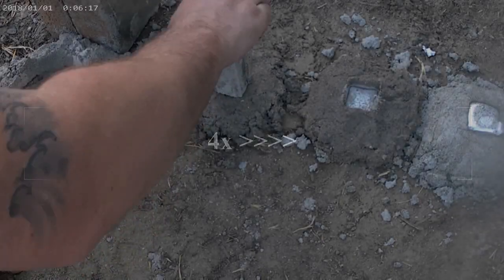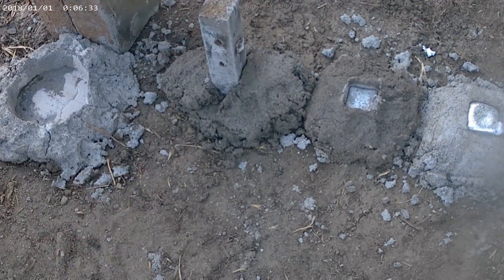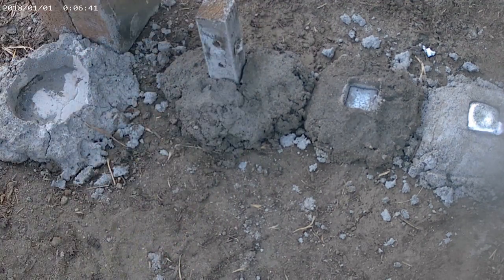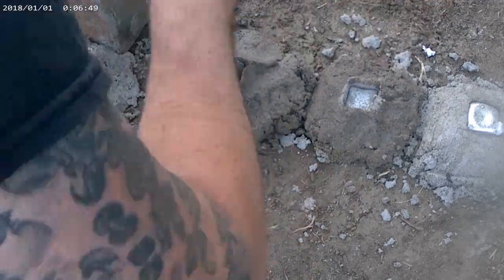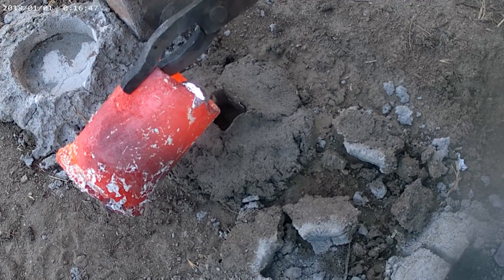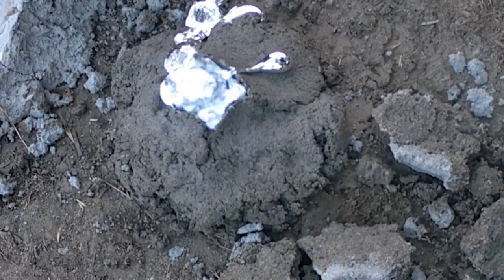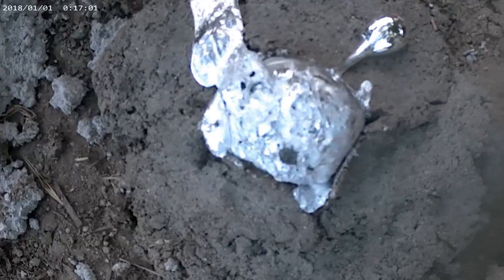A little editing magic after listening to my cats make all the noise in the background. I'm gonna fast forward and make the final mold. It's going to have the most moisture in it when I pour the aluminum in. It's also not a good idea to put molten metal in a wet mold, because bubbles and molten metal generally aren't a good thing to mix.